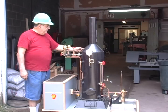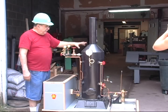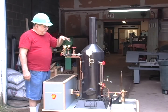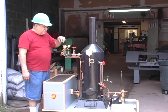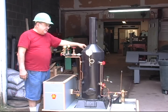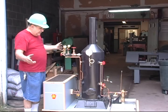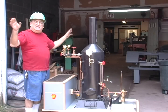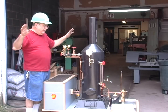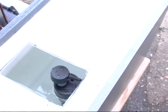We've got a main safety valve back here and a conical valve that's going to be set for 150 PSI, so we're going to run the boiler on 150. The small safety valves will be set at 120, 125, or 130, so we want the main one a little bit higher. We're about ready to test — we haven't tested this gas yet, we know nothing about how it's going to work. This is the 16 gallon tank we bought off the internet.